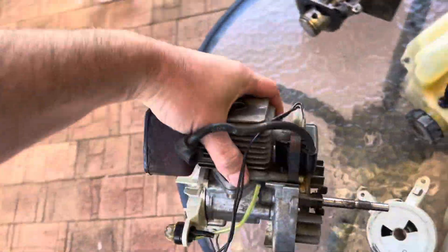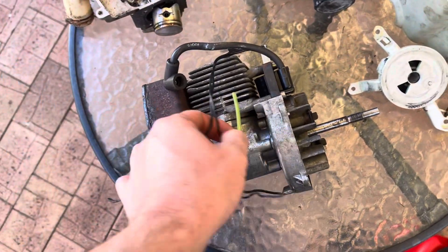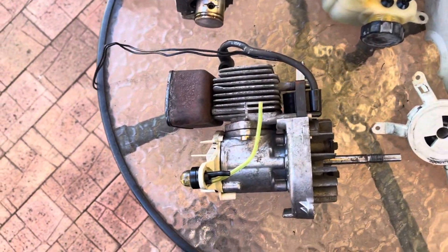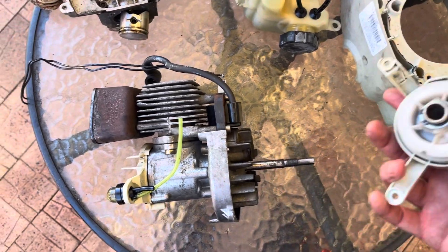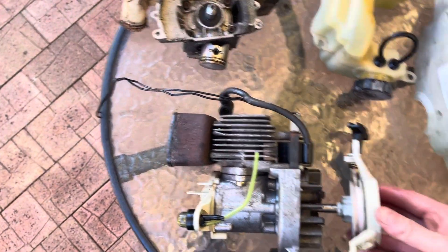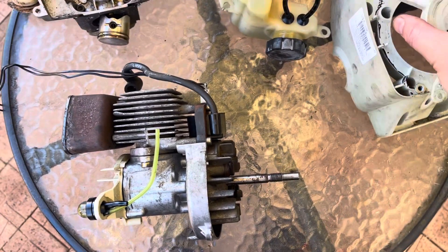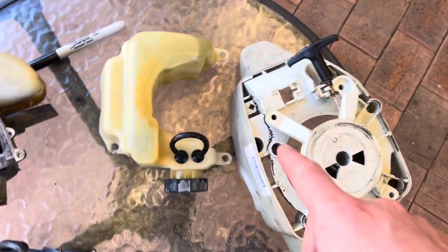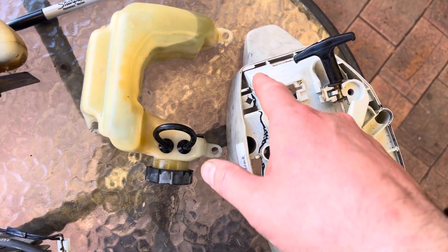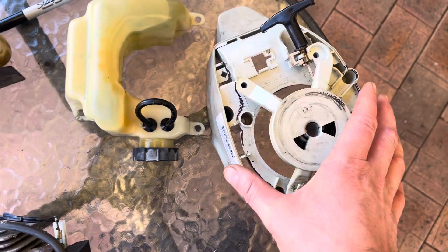But what I need to do is still maintain cooling. Even driving this boat is not going to be enough to cool it down, and when you come to idle it, it's going to get too hot. So I'm keeping the bare minimum - the starter, and of course the clutch will be on here. To keep the starter in the right position it has to be braced up against the outer case, but a lot of this outer case is not necessary. So I've taken a Sharpie pen and marked around where I want to cut and remove all the excess that is literally just bulk.